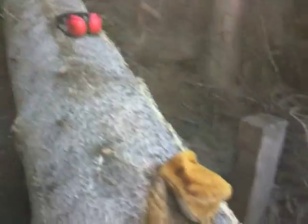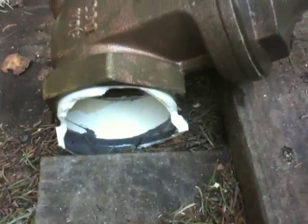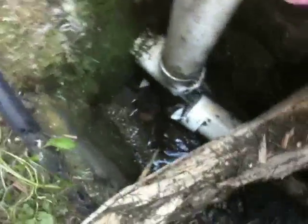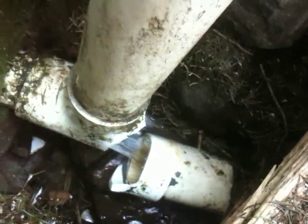The tree has been cleared away — I used a trusty chainsaw. We can see that the valve was broken off; the pipe was just snapped right off. The valve and the strainer are all in good shape still, but the box itself is damaged a bit. The standpipe is cracked right down here at the bottom, which lets air in and drains the pipe. It's just not really collecting all the spring water and you can't fill the pipe all the way. It's a bit of a mess, but it's going to get fixed.